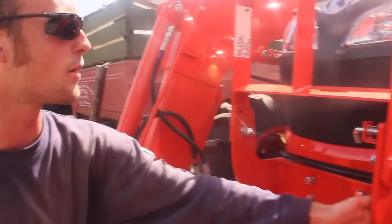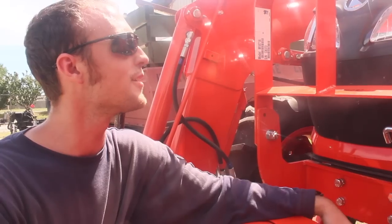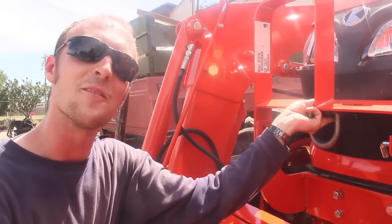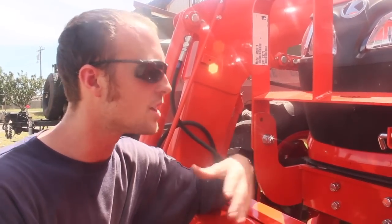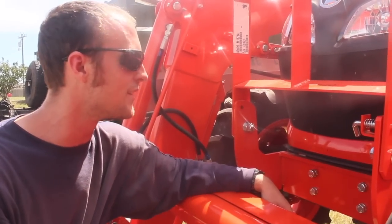The way this tractor's built, this thing we're welding to is essentially a holder for a brush guard, but it's made out of half-inch thick — actually a little more than that — steel plate, and it's bolted directly to a really sturdy subsection of the tractor that can definitely stand the load. If you have a flimsy brush guard, don't weld a D-ring to it and try to pull stuff from the front of your machine — it'll be really bad. You have to be sure not only of what you're welding on but what's underneath it, and this is structurally sound enough to do this.